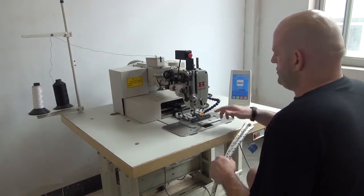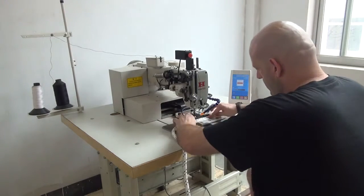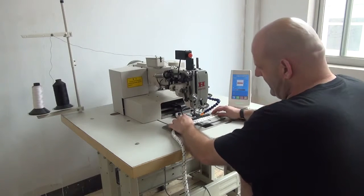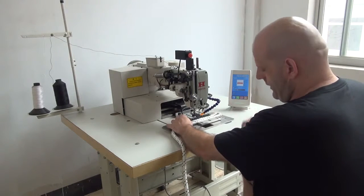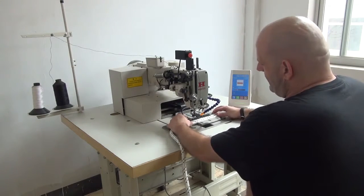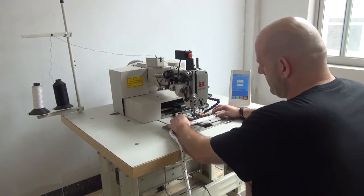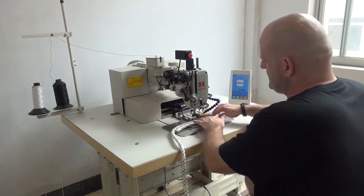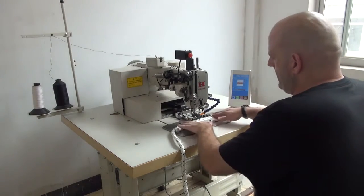That orients the machine in the proper position to begin sewing the pattern. The next thing we do is insert the material into the machine. Then I'm going to press a pedal mechanism down here, which is an air-activated clamp mechanism. There are two pedals — one on the right and one on the left. The one on the right is used to activate the clamping mechanism. The one on the left is used to activate the sewing machine when you're ready to sew the pattern. I'm going to push the pedal on the right-hand side, which squeezes the clamp together so that it holds the rope in an even grip.